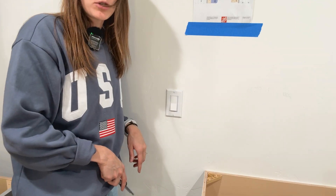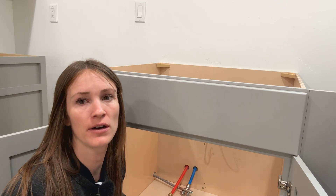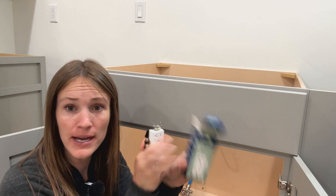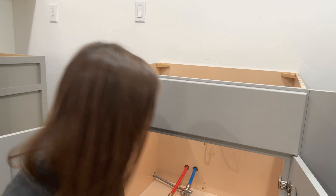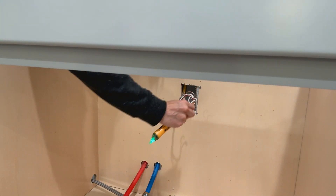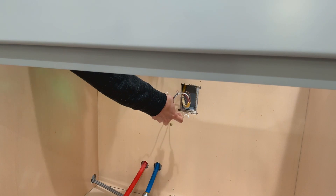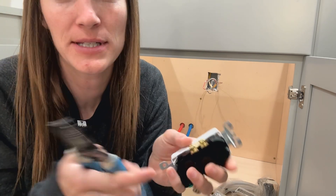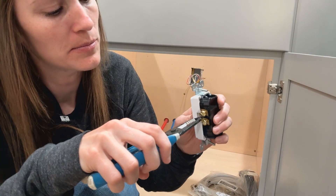It is the next day. Now we're going to wire our outlet at the bottom. First thing we always want to do is make sure the power is off — I've turned it off at the breaker. Now we only have the one wire coming in: white is our neutral, black and red are our two hots, and we have our ground. We need to break out that little tab on the hot side of the outlet.